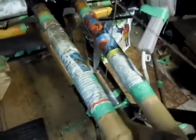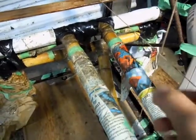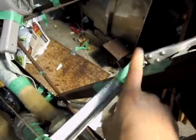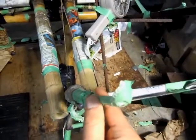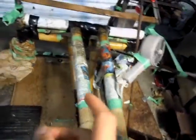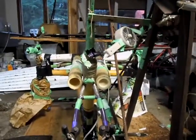And so I had this vertical string first on one side and then the other side of this horizontal string, and made my adjustments from here. So I just undid that vice grip and then moved this piece back and forth, which moves the seat post back and forth, or side to side, which is changing its vertical orientation from left to right. And it seems like it is aligned.